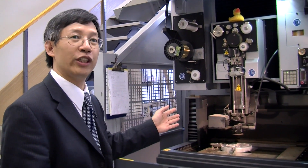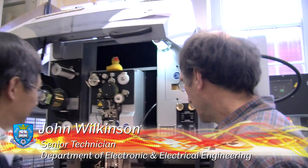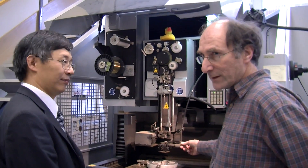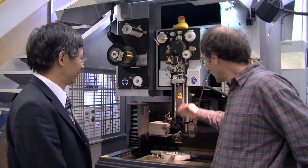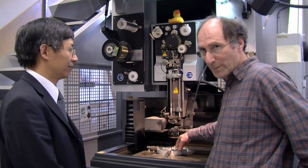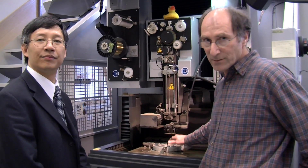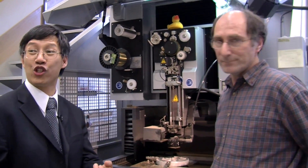This is one of the wire eroder machines to cut the laminations and to cut the magnet. This is a spark erosion machine — a wire erosion machine that uses a fine brass wire to cut metal. The action of the wire going through the job causes a spark onto the job. There's a voltage across the wire and the current passes through the metal that cuts it. We're able to cut virtually any kind of metal as long as it's conductive — aluminium, steel, copper, a whole range of metals. But we cut lamination and magnets more than any other material because they are the two major components for our machines and generators.